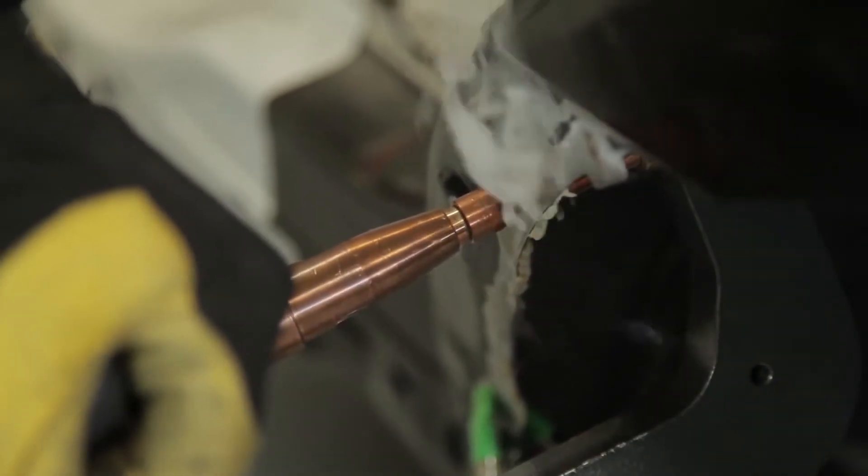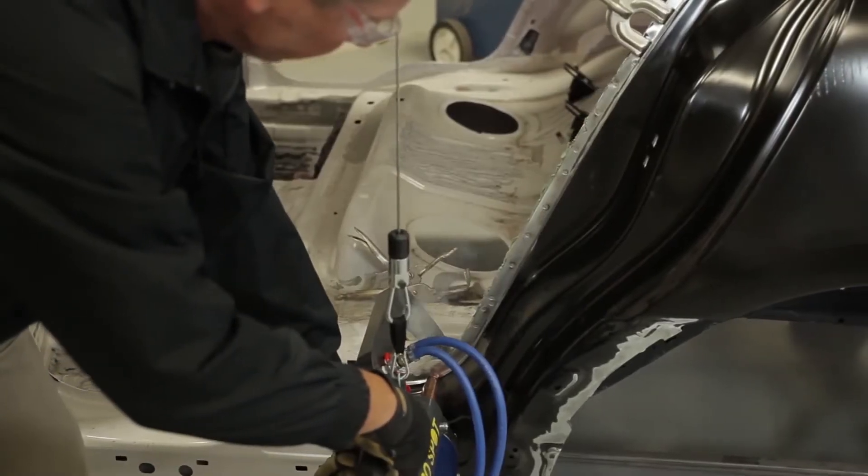Kai said to overbuild — do you see anything more than 440? There are machines out there now that are 440 volts, which gives you more latitude on what you can do. If you don't have it in your facility, it might be pretty expensive to bring in a transformer. The biggest thing we need to do as an industry is understand the power we have in our facility and how to maximize it. The biggest problem in today's shop is they don't have three-phase, and when they do put it in, they put the small wire in. I suggest when putting in new welders to use at least number four wire with 65 amp service. You have to figure that into the cost of putting in that piece of equipment. Call your electrician out.